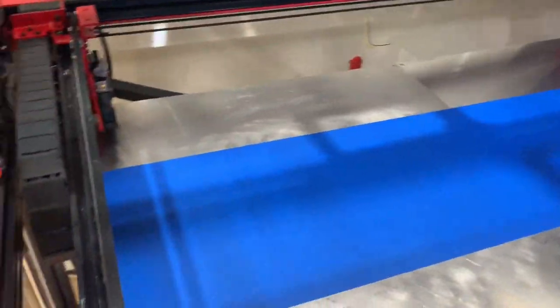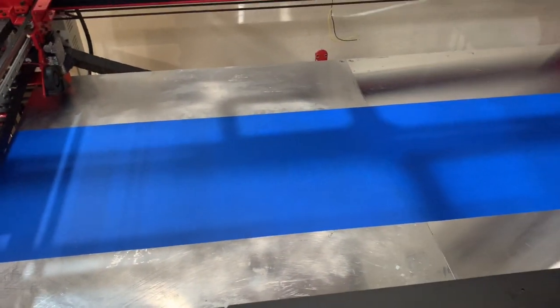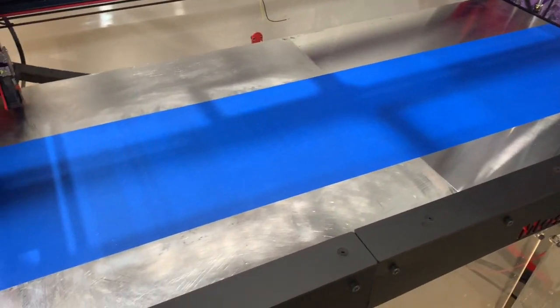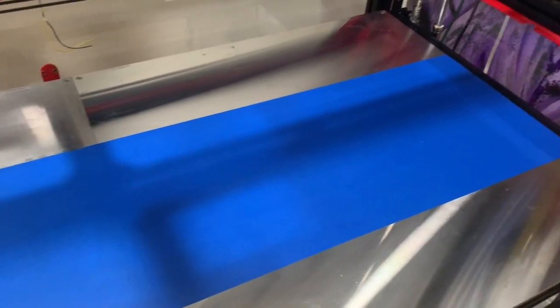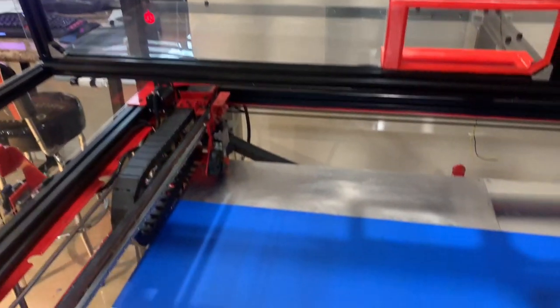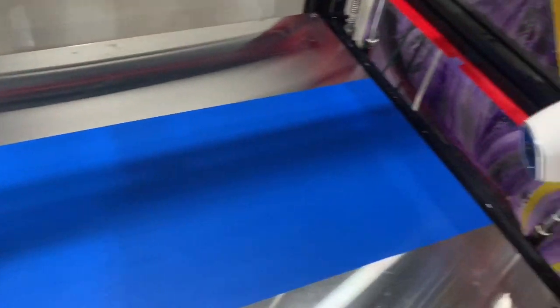This is going to fit on the bed, printing it upside down so it's flat. This is my back left rail piece, and we'll see how flat it can come out. Since it's important that it be as flat as possible, I've got blue tape down on my aluminum bed, which I'm heating to 50 degrees Celsius. I'm going to leave the lid open, as per the Modix team. PLA doesn't really like a closed atmosphere with heat, which actually makes some sense.